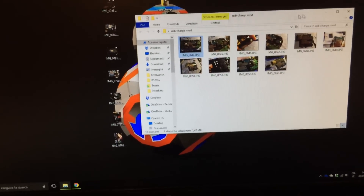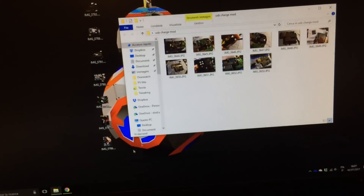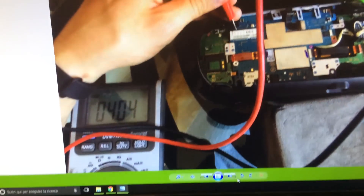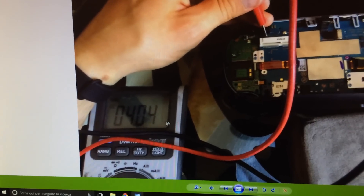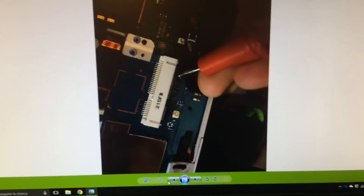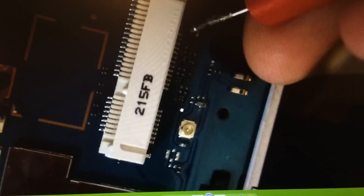Now for the USB host port. I removed the 3G card and measured the voltage, which turned out to be only roughly 4 volts, meaning the slot was only being provided battery-level voltage. I would need a booster to get 5 volts. This is the pin where I'm measuring to get the positive voltage, and you can hook up to any negative pad like here or here.